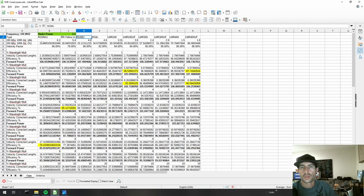The way loss is measured is in decibels (dB), always rated over 100 feet. RG-58/AU has 6.2 dB loss over 100 feet. Every 3 dB your signal gets cut in half, so at 6.2 dB over 100 feet you're only getting about 24% making it to the other end. It's terrible.